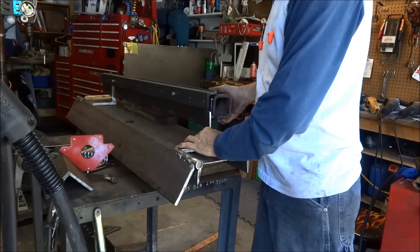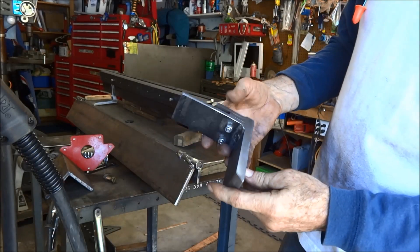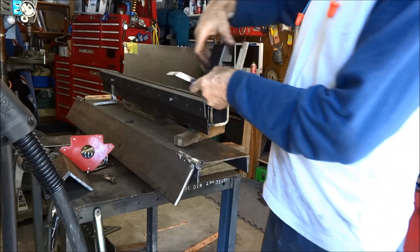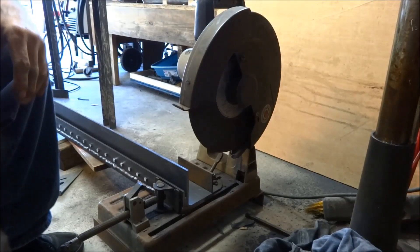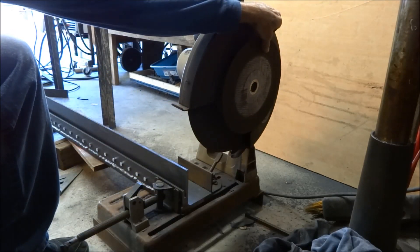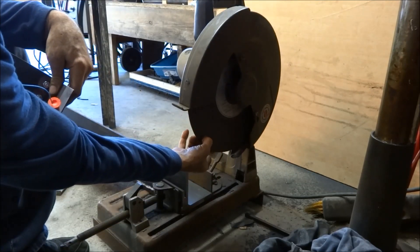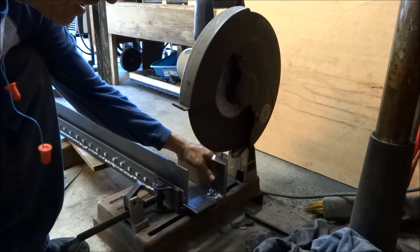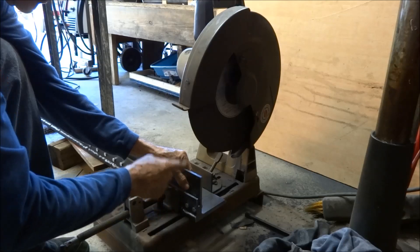Got two of these cut so far. I'm going to put a little gusset in the back edge of it to make it a little bit stiffer. In order to save blades I've been swapping to this one, cutting most of the way through both sides, and then cutting the last one with a new blade, because it takes almost a brand new blade just to reach through. First I set it up this way, cut all the way down, then I turn it, get it lined back up with the cut, set it the other way, and cut down the back side all the way through.